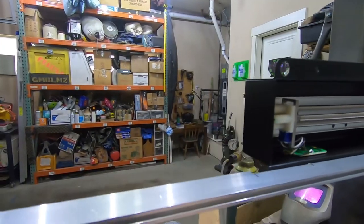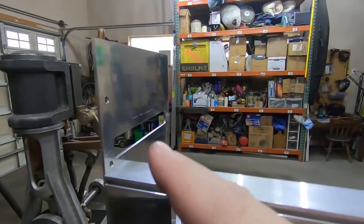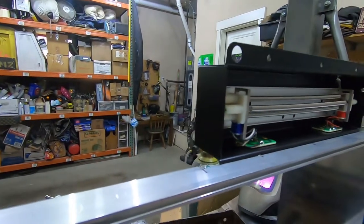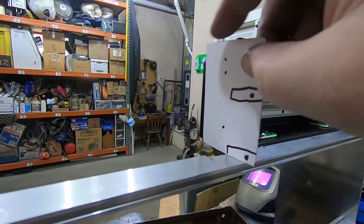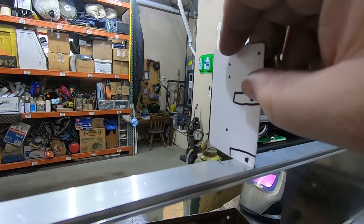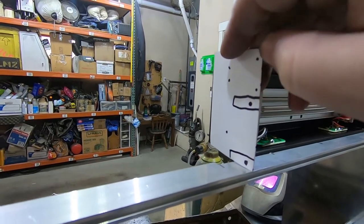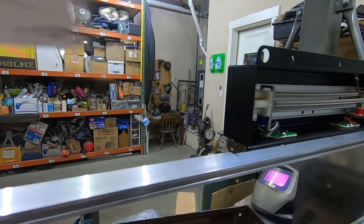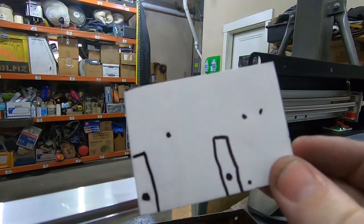It's time to think about the 1U rails. They already have mounting holes on this side on that plate, but there's nowhere to do that over here. So I'm going to make another little aluminum plate that'll go here. It'll bolt to the tank. That'll be its main attachment point. And then it'll have the mounting holes for the 2 rails. And then it'll also have another 2 holes up here for the thing that's going to span the open gap up here. So like this, but aluminum.